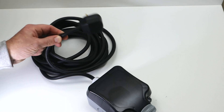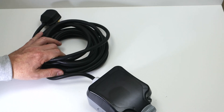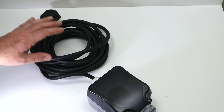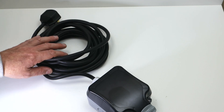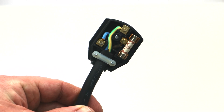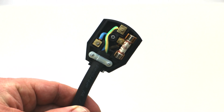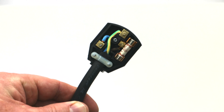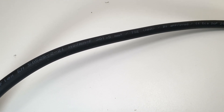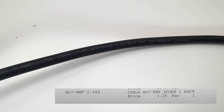I've just basically put a standard three-pin plug in there, so this will obviously be plugged into the house and then you would just run the whole thing out. How long you make this cable is up to you — I've gone for five metres, so I've kind of got 10 metres in total, which is usually more than enough. This is really easy to wire up; it's just a three-core cable going into this plug. It's got a 13-amp fuse on it because granny chargers or slow chargers normally run at 10 amps, so that should be absolutely fine. The cable is a Supreme Flex EN 50525221, or more commonly known as an H07RNF.